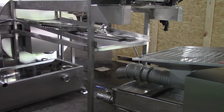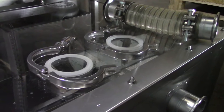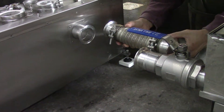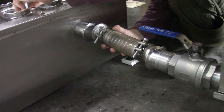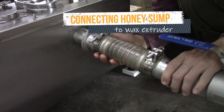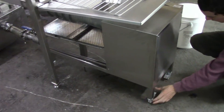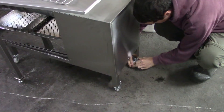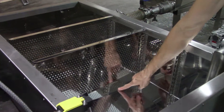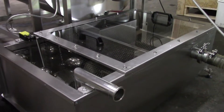We're rolling in the wax extruder so that the edge of the hopper just goes underneath the ramp where honey drips from frames after they're uncapped. The wax extruder catches all those drippy cappings and squeezes the wax cappings to get the honey out of them. We're going to connect this extruder to the side of the sump opposite the extractor with two more sanitary fittings. Once the extruder rolls into place, lock those wheels. Install the coarse baffles near the inlets to the sump, and install the finer baffles closer to the outlet. There are many ways to reconfigure the sump baffles.